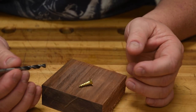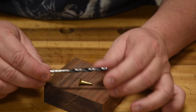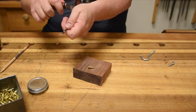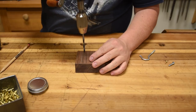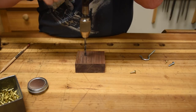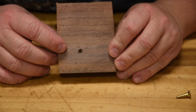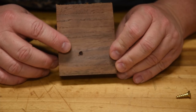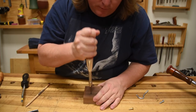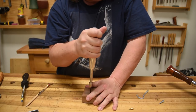In those situations you just treat it like solid wood. So I have a screw here and I want to put the hole in the very beginning. I like to start with the bigger bit because I use brad point bits and they have that center point. So I'll load up my bit, center the hole where I want, and drill the hole just the depth of that shank - not much more. If you look into that hole, you will see a slight dimple from the brad point. I'll use that to center my push drill. You just find the center point, press down, and you will be surprised at how efficient these things are.